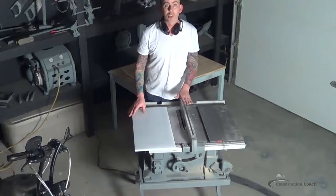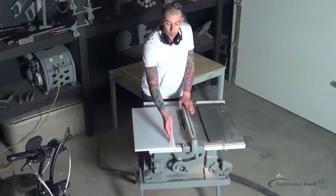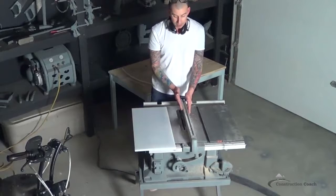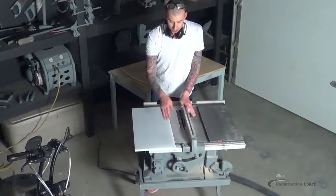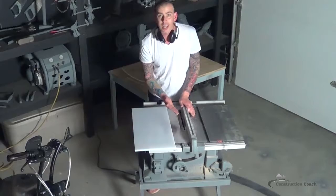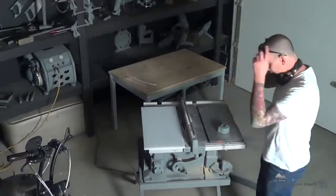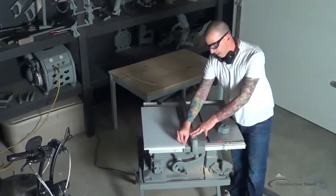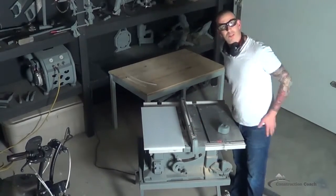I've got my strips ripped off the edge here and the edge here. Those are the strips that are going to go into the dado I'm going to create down this edge and down this edge. I'm going to set my saw at three-quarter of an inch to half inch to make that dado cut, and set the blade to half the thickness of this material. I've got my fence set to make this line half an inch away from the edge, half the thickness of the plastic I'm using for the drawing board.